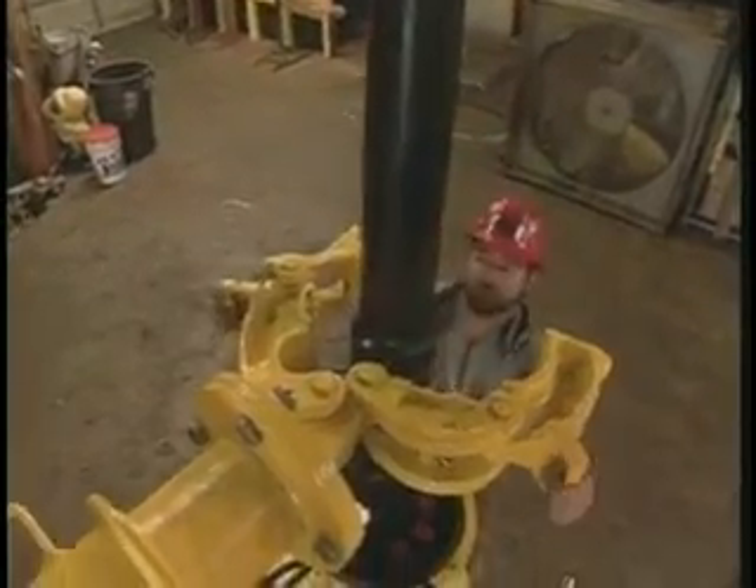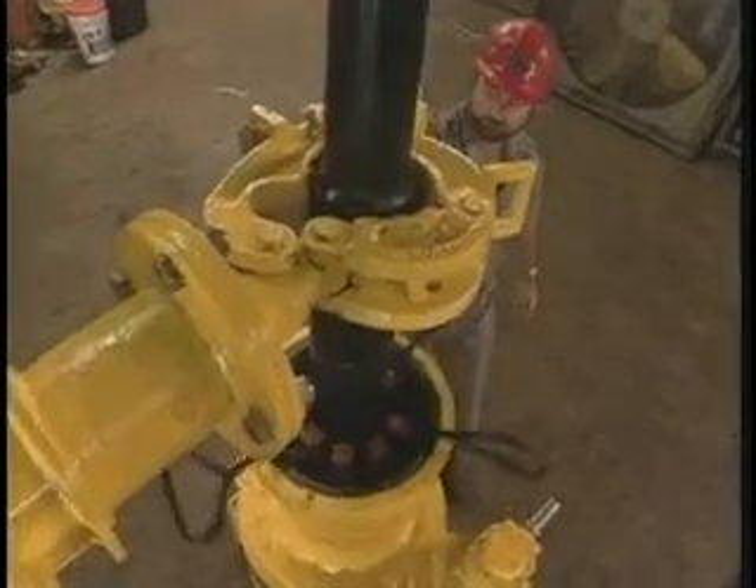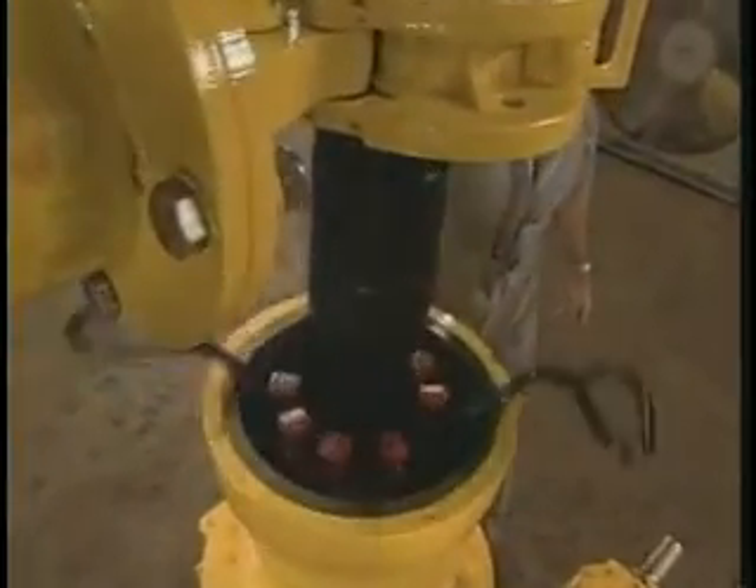They use air motors to assemble drill pipes up to three lengths. This is all done in advance, so it saves time on the drill floor and eliminates chain in the pipe coupling. Getting rid of the chain is more for the safety of the worker. Using chain is not the safest thing on the drill floor, and by using this mouse hole, it makes the pipe up without the use of chain. The chain can be dangerous in that it comes loose, hits people, and it's slower than using this particular piece of equipment.